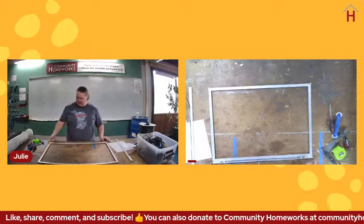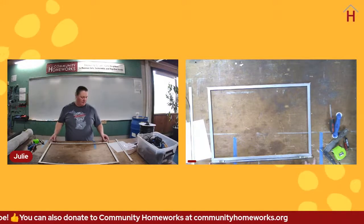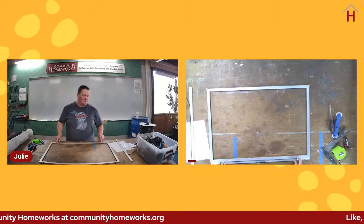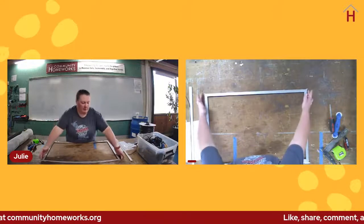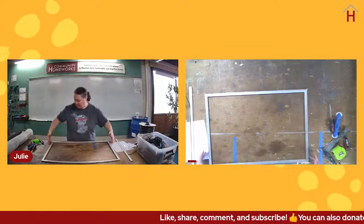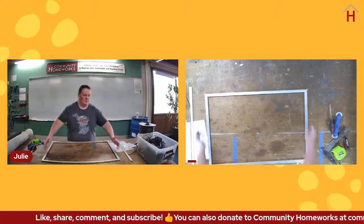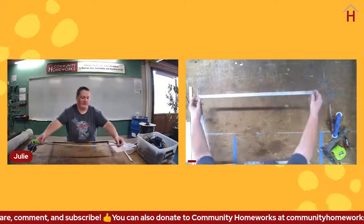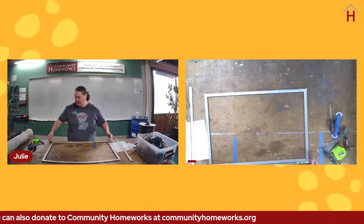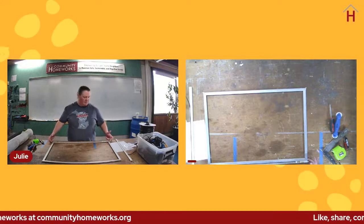When you've got one like that, they usually move using these parts, which are called slide bolts. And you pull those in order to raise it up or lower it down. And then there are tilt keys. And the tilt keys have a counterpart on the bottom. They're all corners. The ones at the top are called tilt keys because they have these little pegs that help them hold in the track. And at the bottom, it's the slide bolt that holds it in the track, but it still needs a corner.